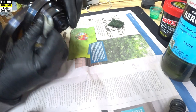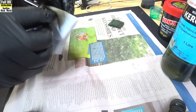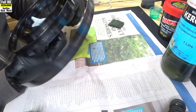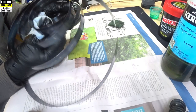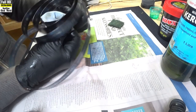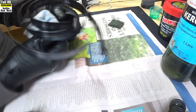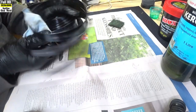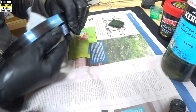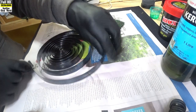It's got a bit of gunk off it. I'll turn the clean cloth over, find a clean piece of it, and just move up here a little bit to make sure we got as high as we did — I'll know that because it's going to crush my fingers. That's about it. Now winding back down again, the full length of the spring with our clean cloth — it won't be clean by the time we get to the bottom. There we have it, that's the dirt we got off this mainspring.